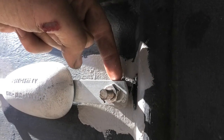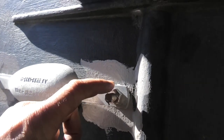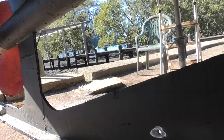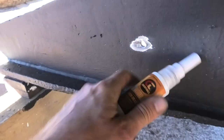Another job before the boat goes back in the water is getting the anodes on. I've already got a couple on the rudder — I welded the head of a stainless bolt onto the stainless rudder, then drilled holes in the straps for the anodes, put them on and put nuts on. Here on the keel, I drilled the hole through and taken some paint off the steel so it's clean. I'm going to fill the hole and put some carbon grease — a conductive grease — behind the strap, bolt it up tight and see how that goes.